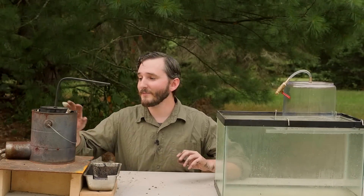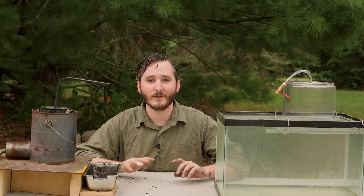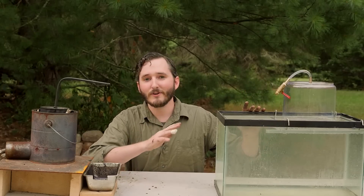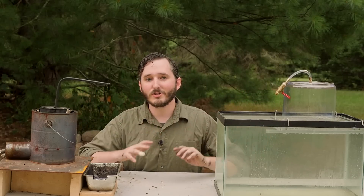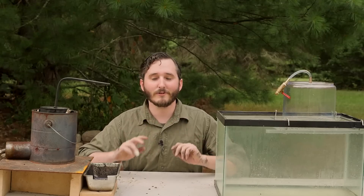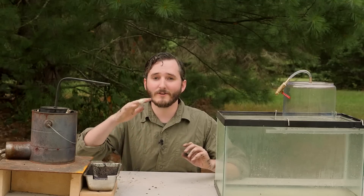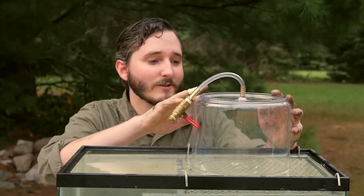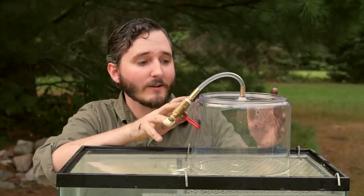I am reloaded and my cans are ready to burn again to produce more wood gas. This is my collection system — I'm using water, because as the gas flows into the water, it should self-filter. All of the liquids in the gas should condense, as well as all the smoke particles — they should just settle out and fall right into the tank of water. This small container, which is sitting at the surface of my fish tank, is the actual vessel that will collect the gas.